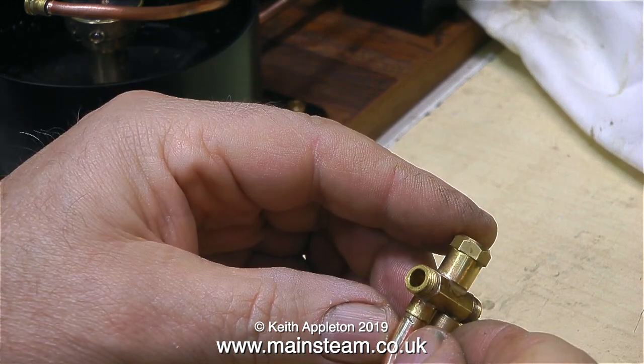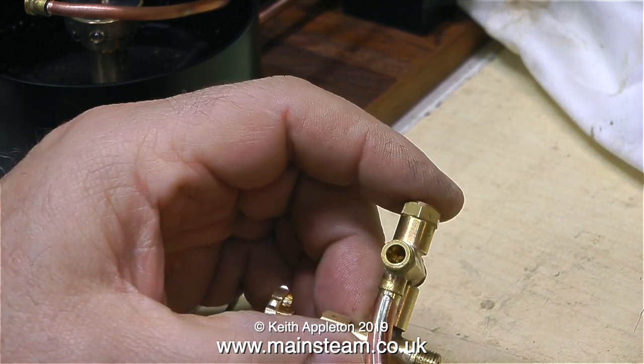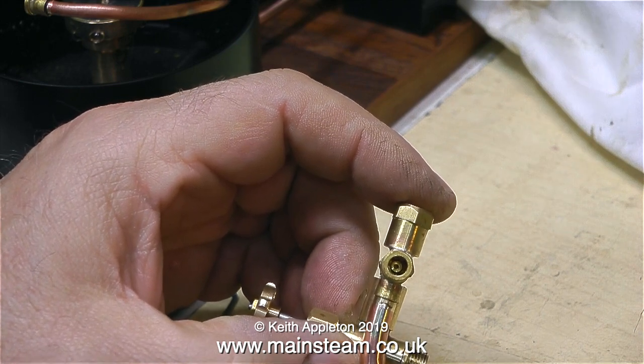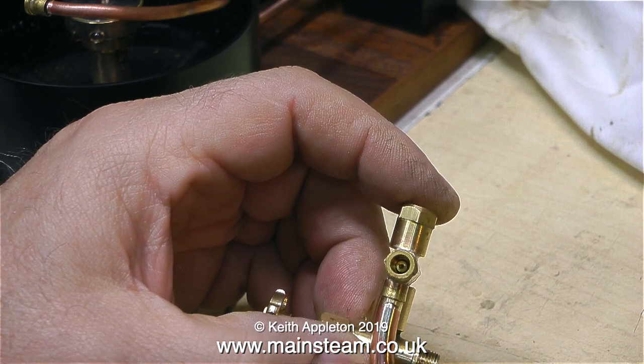The steam condenses in the water, and this mixture of steam and water finds itself in a combining cone, right in the middle — a very small but very important part of an injector. But it's still witchcraft. In this image you can just about see the internal cones. There's a hole through the middle of these cones, and there's also a ball valve which sits in the middle.